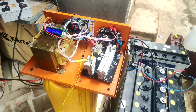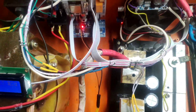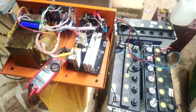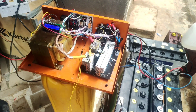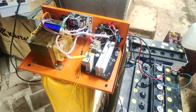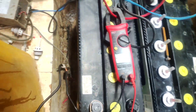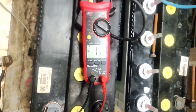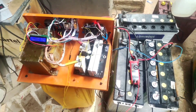The EGS is working so the inversion process is now running. I'm going to turn on the charging and then we will see the charging current. This is what the inverter is currently pulling from the battery. As you can see, it's a 24-volt system — the inverter setup is a 24-volt system — so I'm turning on the charging now.